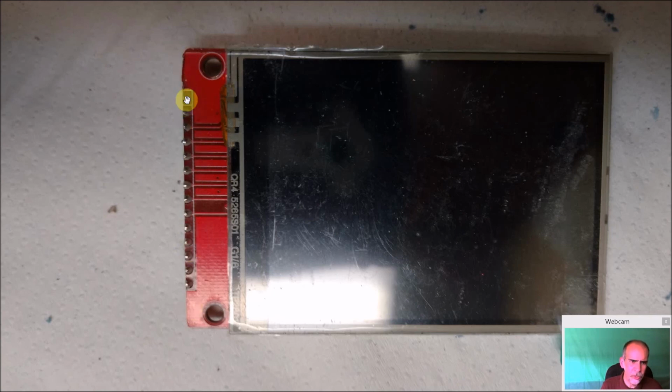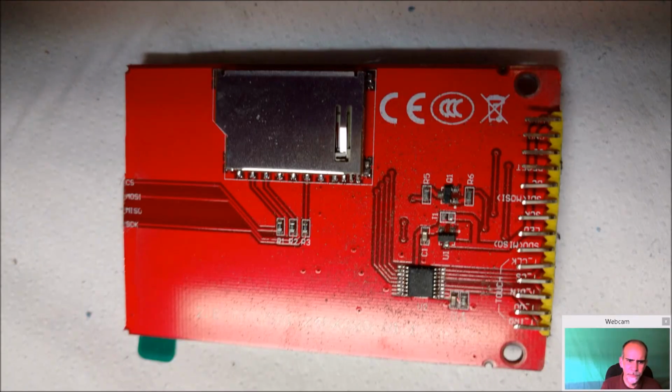Again, you want to get as close to these pins as possible. And you can see over here, the next thing you are going to have to do, and you maybe want to do this part first, I did it after the fact, is you need to have some room to close your unit. So all these pins had to be bent at least about 45, maybe 65 degrees, bend them all out of the way. And you can see the markings all down here. I'll show you more of these later, what these are. But they do have to be bent, and I would probably recommend doing that before you do your cut.